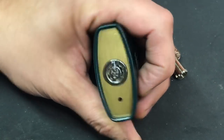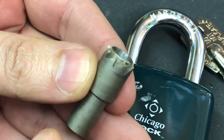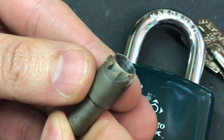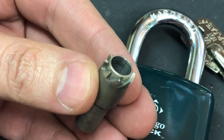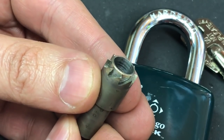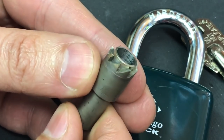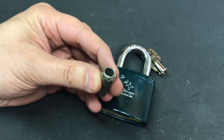The bit that allows you to do this is this little guy right here — the A1 Security tubular lock hole saw. You can see this one has some mileage on it; it's probably drilled out six, maybe as many as eight tubular locks thus far, and some of the points are chipped. But it has two main features: the first is that center collar that fits inside of the lock — it guides the saw and also compresses all of the pins to keep them out of the way of the saw teeth. Then the saw teeth are what actually eat away the bezel of the lock, and it's a really easy way to drill these locks out — frankly it's kind of hard to even screw it up.